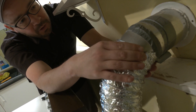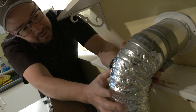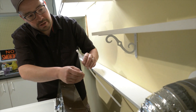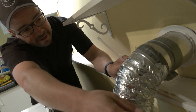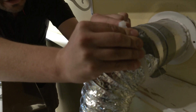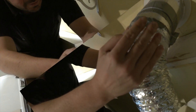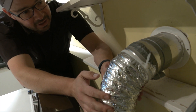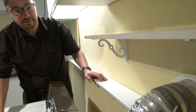This is a 4-inch pipe going on a 4-inch pipe. You can't do a 4-inch to 3-inch or vice versa — they've got to match. What you can do is use one of these zap straps and strap that in order to make sure it doesn't go anywhere. No tools involved, which is very easy. We're getting it nice and tight. You don't need it super tight, just enough so air doesn't knock it off even when moving the dryer around.